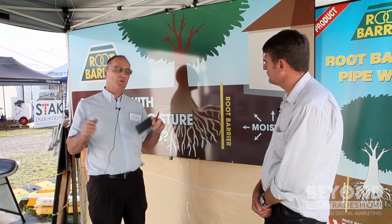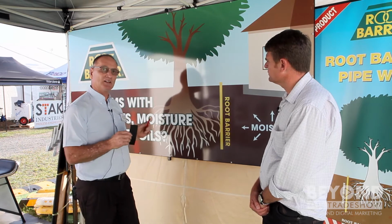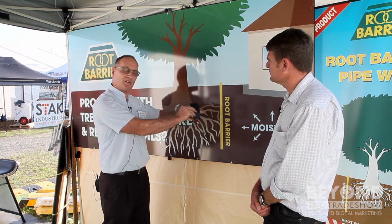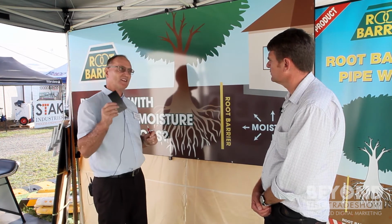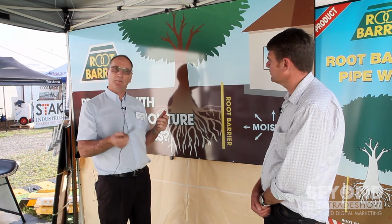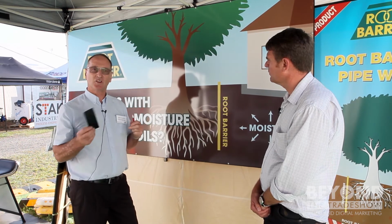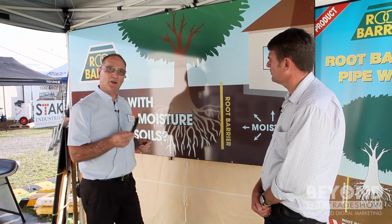And that's what's required in the ground because the shrink-swell index in the soil could be 100 mil. If you've got a root pushed up against it and the membrane stretches around it, if it's brittle or it's concrete, it will break. If it's flexible, it maintains its integrity, and as long as it's got no penetrations and failures in it, it will work. So the moisture constant has to be maintained by an impervious, flexible membrane.